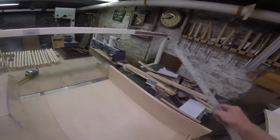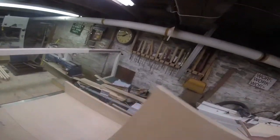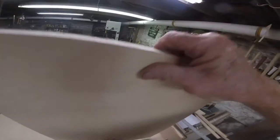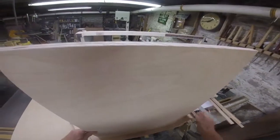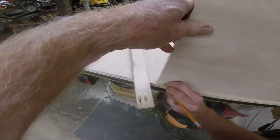All right. Now the next thing will be, this is the bottom shelf. It's just cut rough right now because, as you see, it's got this edge on it, so that edge adds a little to it. So what I do now that I have everything squared, I'll take this, push it tight against what's going to be the back, and I'll take my pencil. This way there's no measuring, there's no chance of making a mistake. And then that's going to be my outside edge right there.